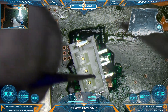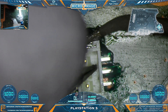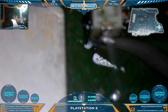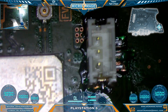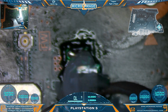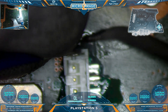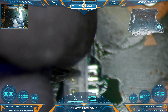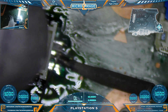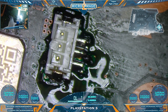Let's get this one anchor down first - that way we can flatten it and then we'll worry about the other anchor. My theory about getting this other anchor after we test... okay, so that in theory was an idea but I think we're going to pull it and tin that anchor - it's going to work better with solder on it. If I had had enough space it might have worked but I don't. Just solder it like that, flatten it as much as we can. Solid, solid, solid - that connector is not going anywhere. Excellent, clean up.